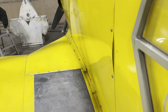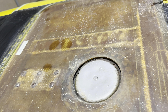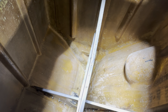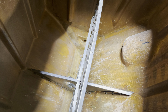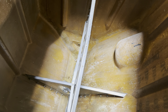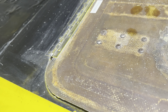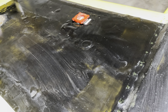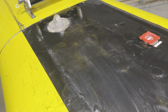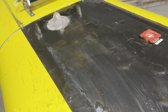Moving on, let's take a look up at the wing. If we hop up on the wing, we have our fiberglass hopper which is right in front of the cockpit. I think the hopper on this is 150 gallons — we generally take about 100 to 120 gallon loads out of our airport. Right in front of the hopper we have our fuel tank; this little red cap is where you would fill your fuel. Right in front of that you have your fuel gauge — it's a clear float-type sight gauge, easily seen while you're sitting in the airplane.